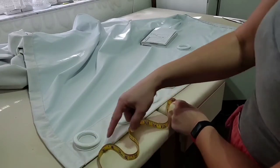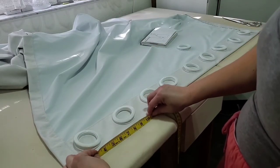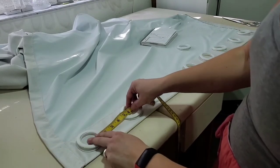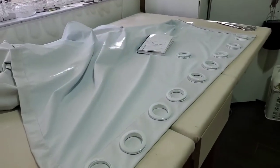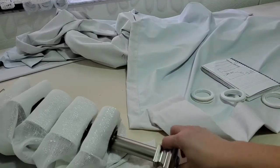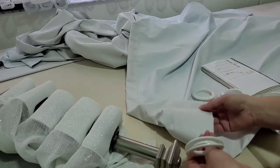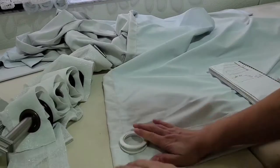So if you stretch three by three out, that's going to make a six-inch spacing. This is how you want to place your grommets, about six inches apart. Here's your rod installed and here's your wall. Let's assume it's about three inches — make sure you have enough room for the curtain to go back. Consider that when placing your grommet after you account for all numbers.